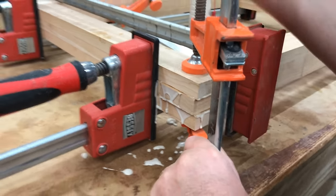And now for the screws. These are pretty serious screws. They are GRK structural screws, number 12 by 5 5/8. These have a tremendous amount of strength and aren't going to break under any sort of loading that we could ever do to this. Now I'll clean up some of the excess glue here and set this aside. And there we have it, two fully complete leg structures.